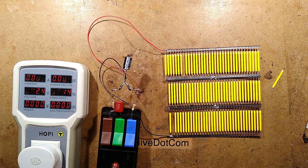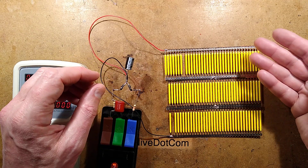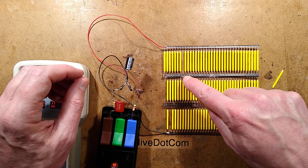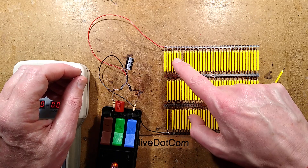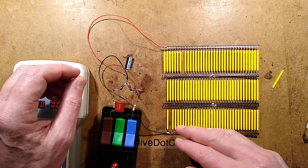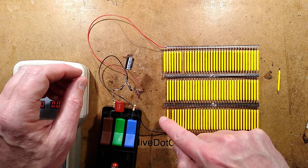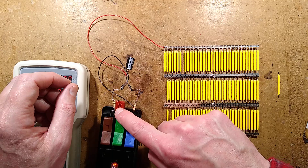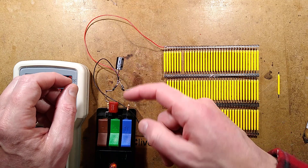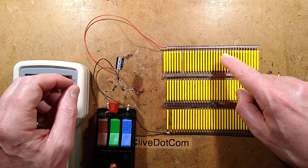This is looking pretty good. There's a matte side and a shiny side to the strips — the matte side is the side with the LEDs facing up. I noticed there are little red dots where there are missing filaments. In the factory they must have powered up big sections of strip, gone along with a Sharpie, put a dot where they're faulty, cut those out and shipped them. So there are a few missing from various positions. The power supply is the 470 nanofarad capacitor with 1-megaohm discharge resistor, 1K inrush resistor, and a discrete bridge rectifier with its own discharge resistor, with the filament sets all connected in series.